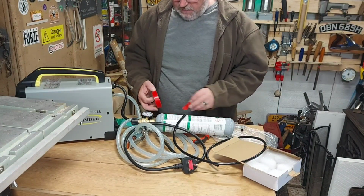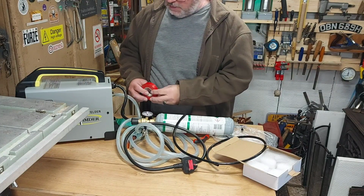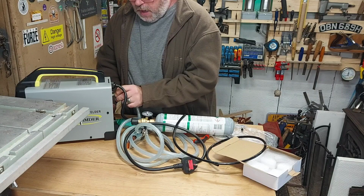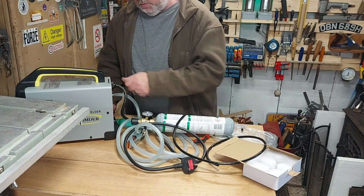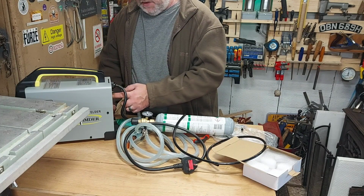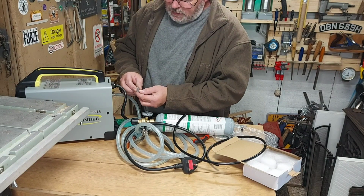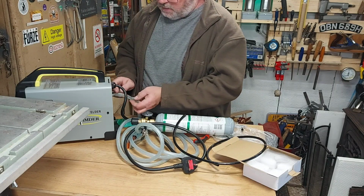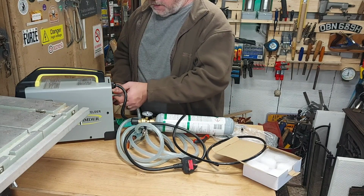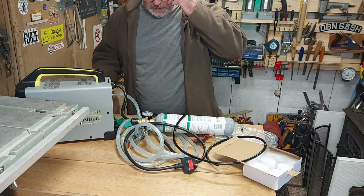Okay, we're finally there. What I had to do was use some insulation tape and rip it down the middle and wrap it round, because there's a massive step from the barb bits on the front of the adapter that you push onto. It's a big drop down to just the cylindrical piece behind it. So the pipe is going a massive way. This pipe seems unsuitable for that connection. But wrapping it a load of times until I got it to the same size as the front piece seems to have worked. So now it doesn't leak.